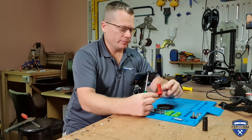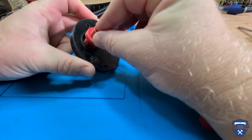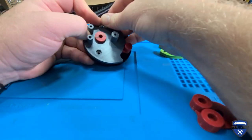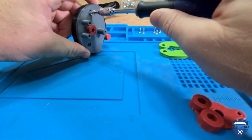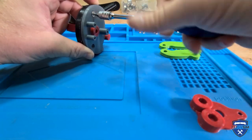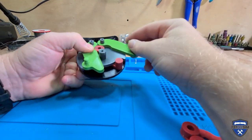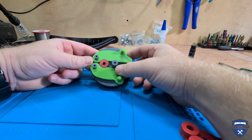First up is the base and the shaft - they basically just push together like so. We've got our top plate which then goes on top of the shaft and we line the holes. All the screws I'm using today are 4mm in size and they're all countersunk, as they need to be below the surface so nothing interferes. Next up are the tongs in green and they just slot over the two studs - they're part of the centering mechanism.